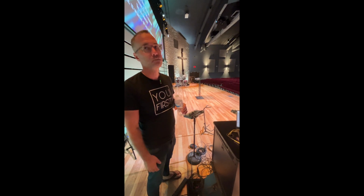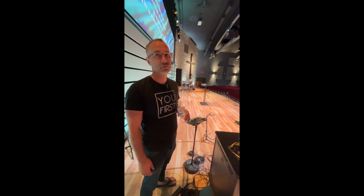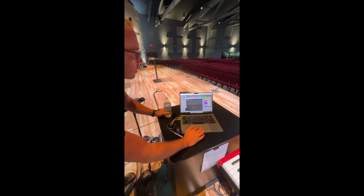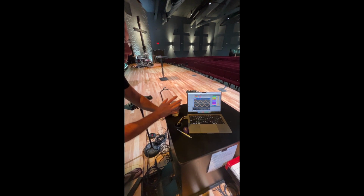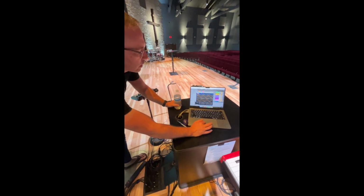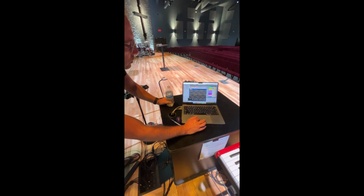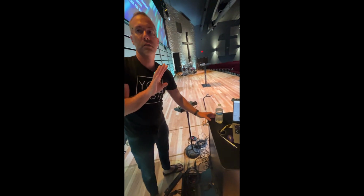So whatever program we even switch to, we'd have to program it to say 427 is this light. Yes, and that's what I did in this thing. That's a good point. I do have a Google sheet that is mostly pretty much all accurate. I think we did make the updates where one of these lights is DMX channel 1 through 5. So it uses 5 channels of DMX. So brightness, red, green, blue, white.